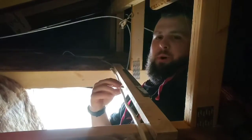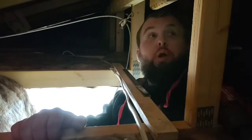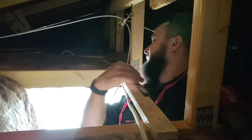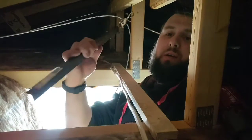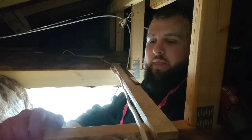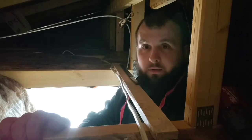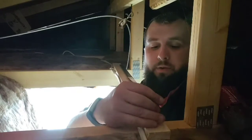I've got this one piece of wire right here that's probably not going to get hit with the cable — but the word 'probably' is the part that bothers me. So what I'm going to do is take some one-by and make a stop for it, running this along the side of the wire. I've also got a piece of angle iron left over, and I'm going to put that so if the cable rubs anywhere, it's going to rub on that metal plate instead of rubbing through the insulation of the wire — because then I'd be cranking on the metal handle of the metal cable and get electrocuted. So that's one thing I'm doing right now so I don't end up dying later on.